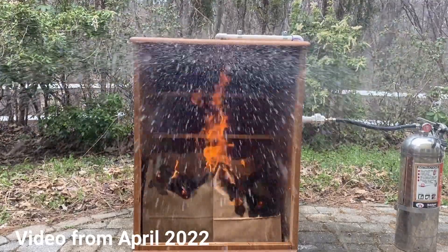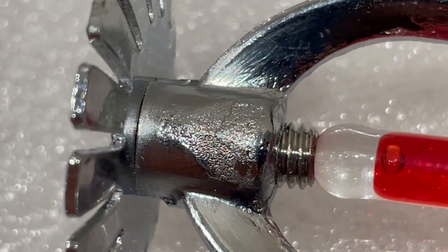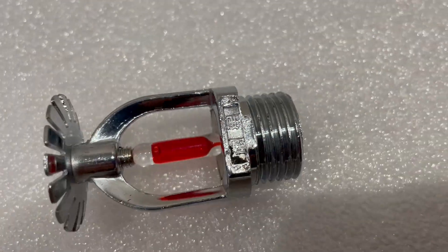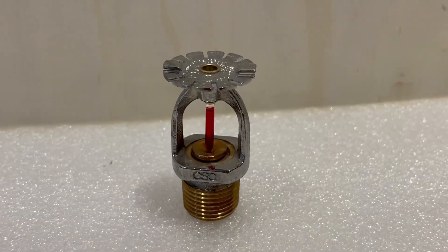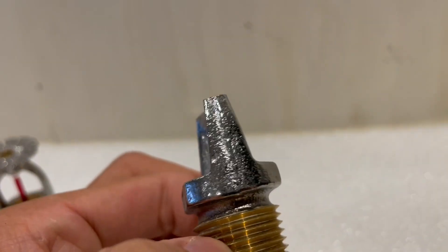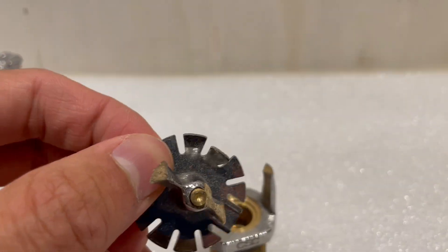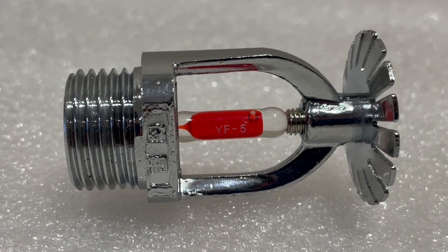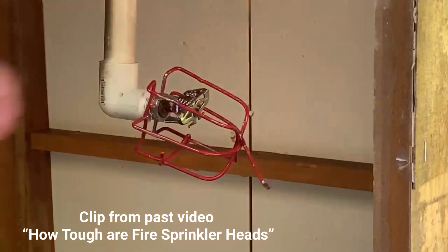There's a deflector of course. Right off the bat it does look like this is a cast sprinkler head — you can see some imperfections, it looks like they have a mold and just pour in. I'm also not sure what metal this is made of. It's definitely not brass. Most sprinkler heads in the United States are brass. Here's a destroyed sprinkler head — the outside has a chrome coating but where it's been sheared off it is brass, and the threads are also brass.